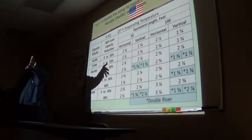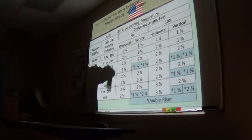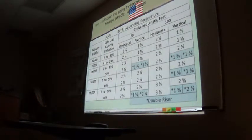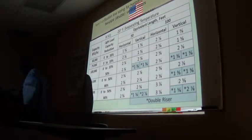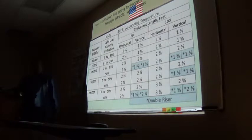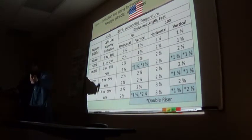You see it in a lot of restaurants where you go in the first door, this is a regular cooler, and you walk in, and the next door opens into the freezer. They share a common wall. That's a double box, and in 100% of the cases, they have their own condensing unit and blowers, but they do share that common wall. And if they share a common wall, the load on both boxes is reduced.